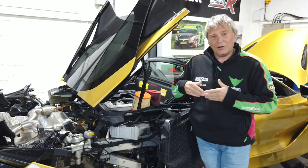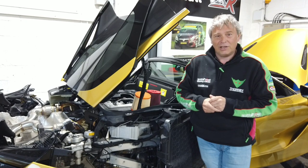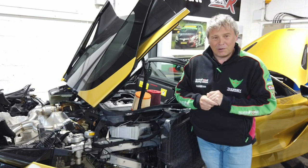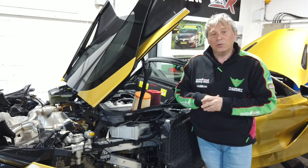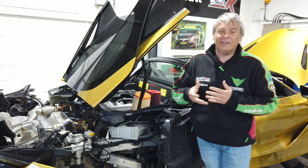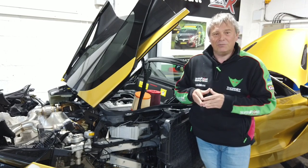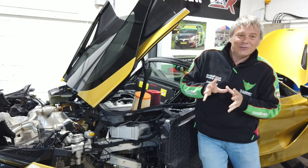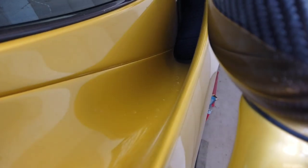This is crucial because it indicates what McLaren have done in terms of taking airflow from the front of the car and ramming it into the engine. We learned with the 12C that McLaren's expertise in aerodynamics is pretty astounding — very low intake temperatures on a dyno, maximizing huge amounts of power by getting as much air in as possible, both around the engine bay and into the radiators. That extended with the 650, again with the Sport Series, but they moved on a country mile with the 720. I still don't like the headlights, but I understand now why they've done it — so much airflow is taken from the front and channeled into the back, which is a very impressive engineering feat.